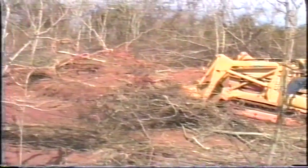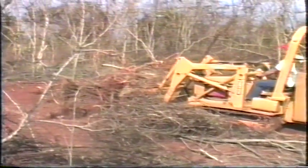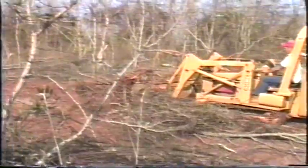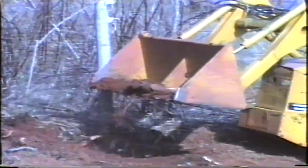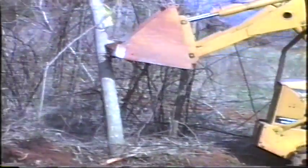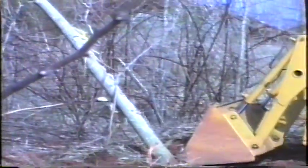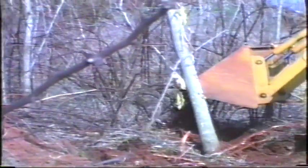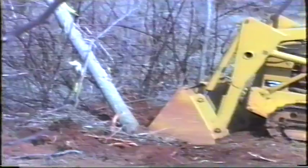Bob put his Magnatrac with customized bucket and exhaust through its paces. In almost 2 hours of informative video, he demonstrated jobs ranging from clearing brush to the complete removal of standing trees. Here, after digging at the tree's side roots, he pushes high on the tree, checking its condition. Determining more digging is required, he resumes digging, removing additional soil from around the tree. In addition to digging, he utilizes his bucket teeth to continue their cutting and tearing action on the remaining support roots. His tree starts to lose its grip.